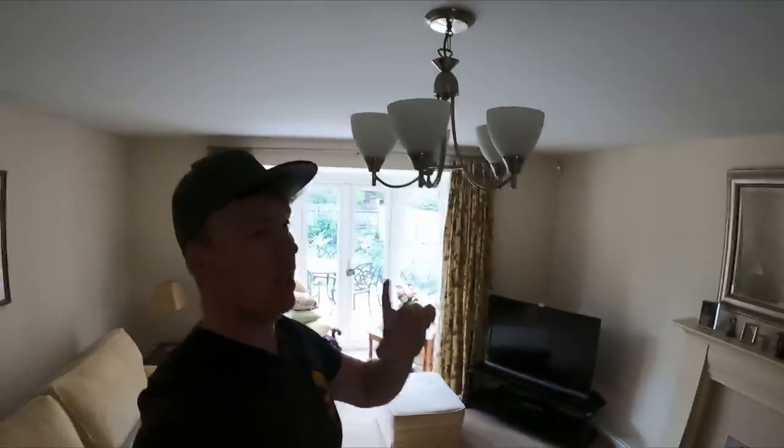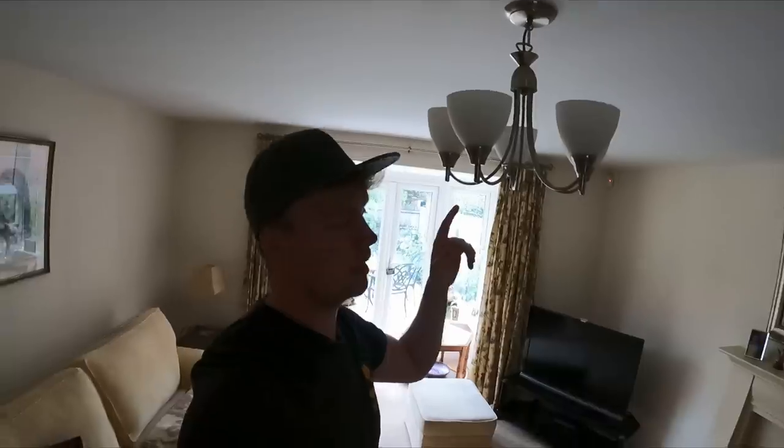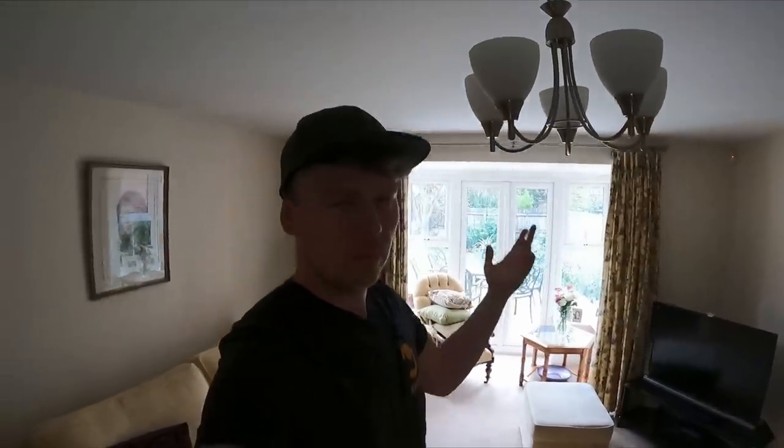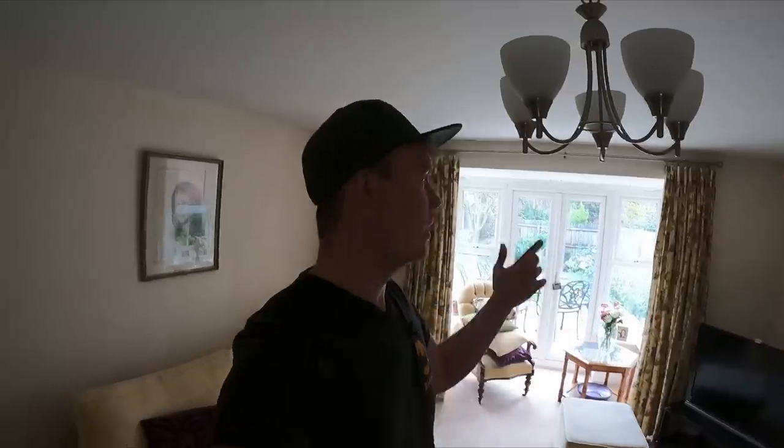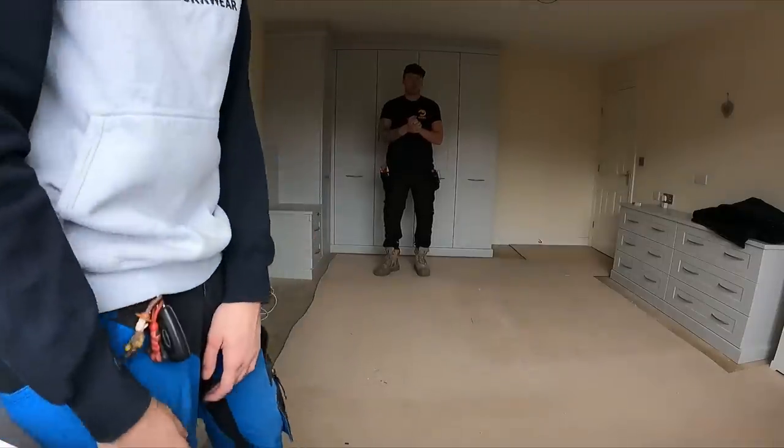The lady's up there with Adam, just running through some stuff. The best thing we've done is take a measurement of this light, taking the measurement upstairs so we know where we're cutting, where the light is, and where we need to access and put a joint box. Then we can come down here once we've got a plan of where the joists and spotlights are, cut some holes and run some cables. We've got a shaver point to go in and also a socket in the garage.